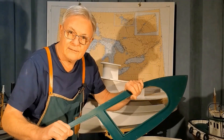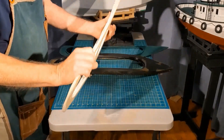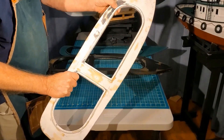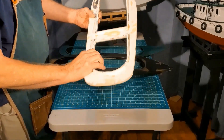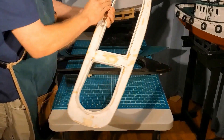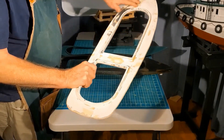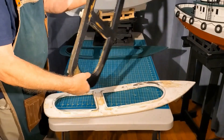Let me show you how I made this deck. Here's the plug, here's the mold, and here's a deck. The deck plug was made of a number of layers of basswood glued together, sanded down, and then covered with layers of resin, repaired and smoothed off with epoxy. I have gel coat on here as well, but I've sanded through in many places. After the plug was all smooth and covered with wax, I put on two layers of gel coat. Then I laid up a number of layers of one ounce and two ounce mat and resin, and built up a mold on top of this plug.